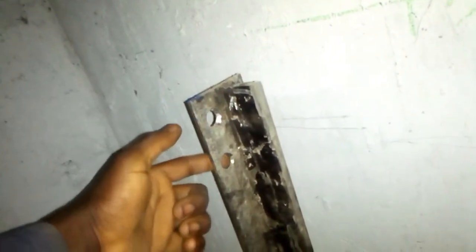So now the machine base has been mounted up onto the platforms, and the guides, we have now installed them back to their initial positions. So these are the holes that we drilled, and this is where the motor base is going to anchor. This is one guide and this is the other guide, and on the opposite side of the shaft we have the guide where the rope stand is going to be installed, and these are the holes for the rope stand. Now down here, that one is our rope stand. It has 8 holes.